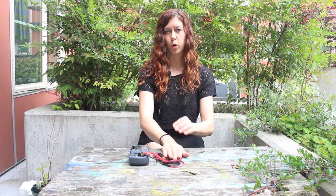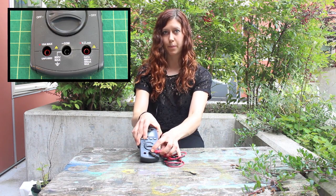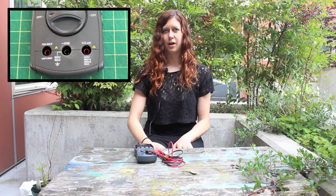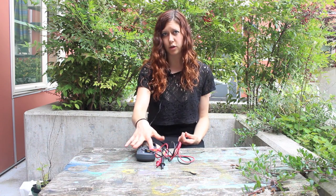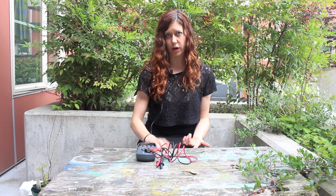It's also really important to get a multimeter that has ports that are separate for voltage and current. That's a safety feature for both your meter as well as you, so definitely get one of those. Other than that, I would just say pay close attention to the manufacturer ratings — there's going to be a current rating as well as a voltage rating on your multimeter, so you want to make sure that fits your particular needs.